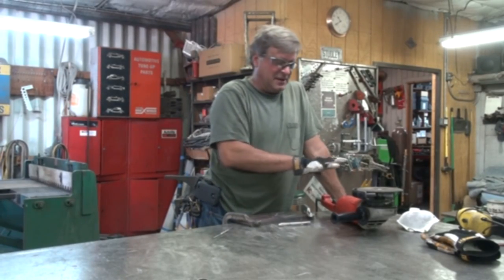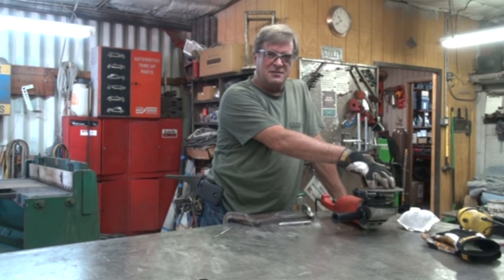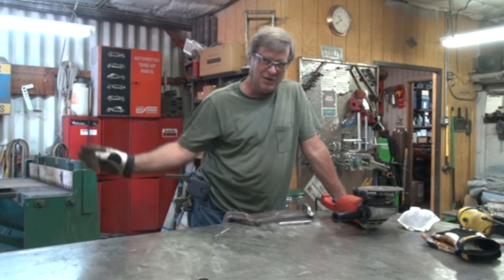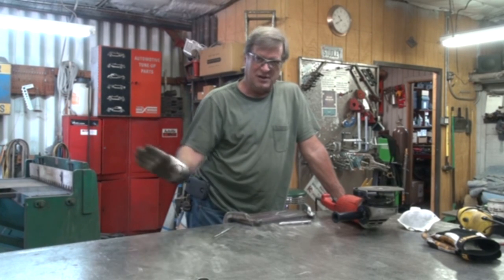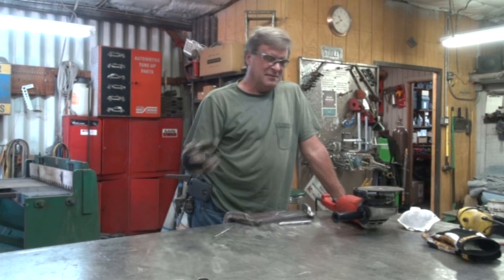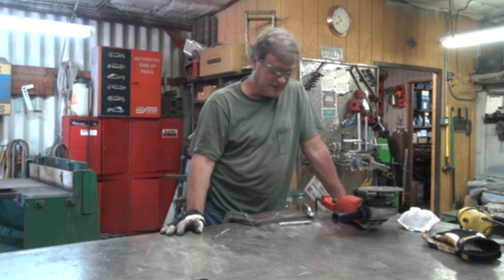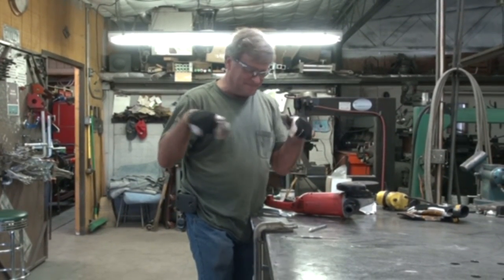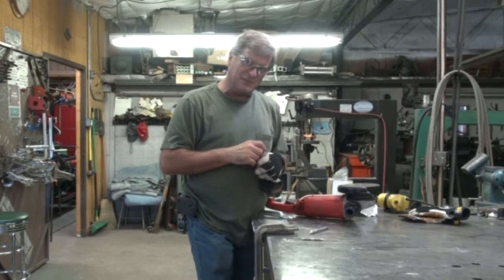I was using a big 7-inch grinder with a stone on it rather than a soft pad to cut some metal. You know, don't want to mess around, want to get the job done, just blow right through it. I'm not worried about how that looks because it's all going to get welded over anyways. Dust mask, hearing protection, safety glasses, put some gloves on, and try to keep in mind where the sparks are going. Hopefully you're going to go push that subscribe button so you know when my next video comes out.